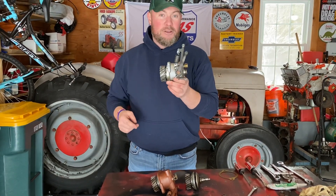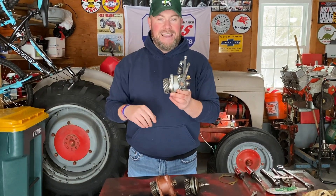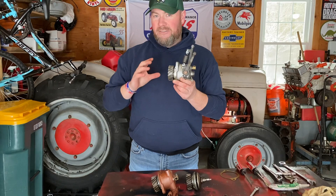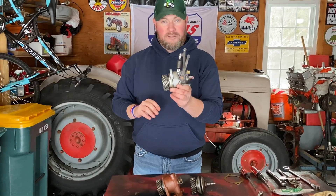Two-arm design — if you have an earlier N-Series tractor it's going to be a three-arm governor, but on this tractor which has an 8N engine, even though it's got some 2N parts on it, you want the two-arm governor. Obviously it comes all shiny and new, and there are a couple of quick things I should have done before I installed this to know that it was never going to work in the first place.